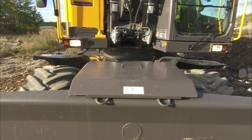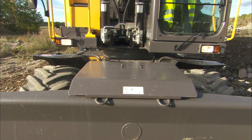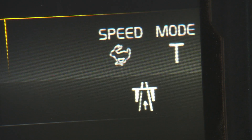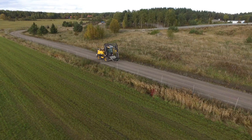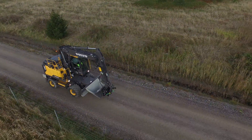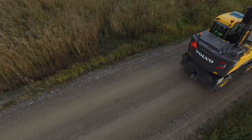When T-Mode is selected but the superstructure and the undercarriage are not completely aligned, the designated control symbol is flashing in the display. When aligned, the hydraulic control levers are not supplied with pilot pressure to avoid unintentional hydraulic movements during driving. Make sure that the pivot axle lock function is deactivated.